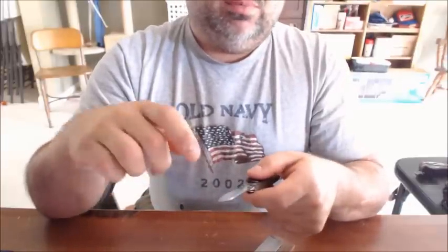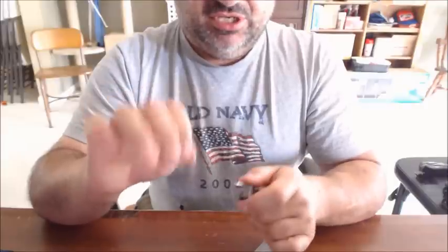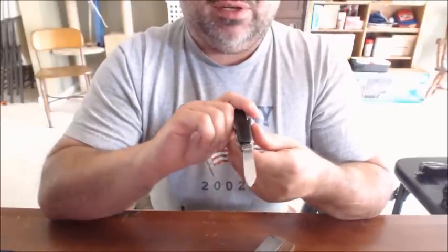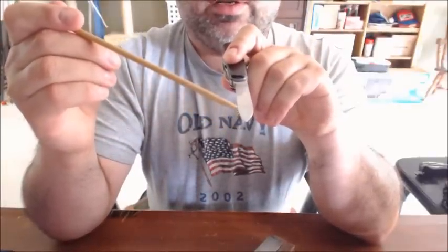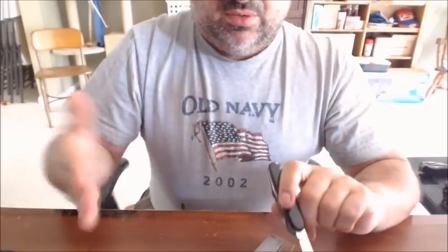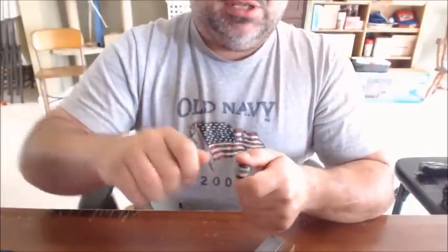So I literally took a pair of needle-nose pliers and flexed it gently and worked it. I could have put it on an anvil and banged it flat, but I tried the nicest, easiest method first — and that's always what you do. Go with the lightest method first to see if you're getting any response. Don't grab the five-pound hammer for a half-pound job. Working this edge — it's still not exactly perfect, there's a little defect right in this zone — because the dude had it bent and buggered up.